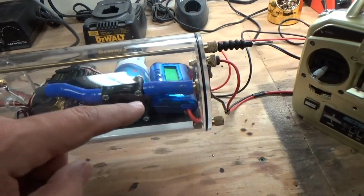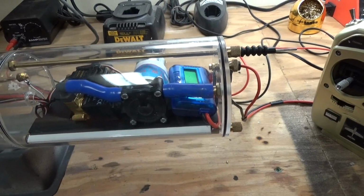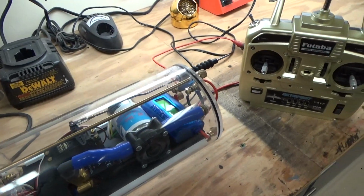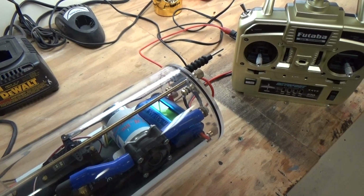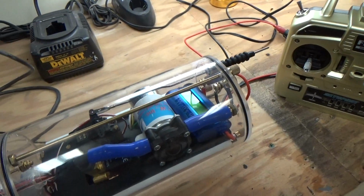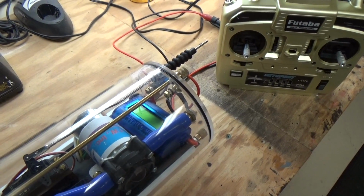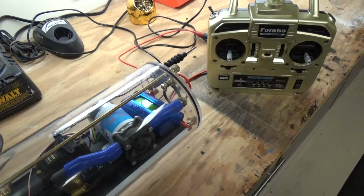In the back here, you can see I've added a Watts Up monitor. It's actually not a controller, it's a monitor. It allows you to check your battery voltage just at a glance. But as a diagnostic tool, it's very cool as well, because it checks amp draw. So you can see if there is an issue with your linkages binding or your drive system binding. You can see what sort of amps are being drawn for that kind of thing as well.